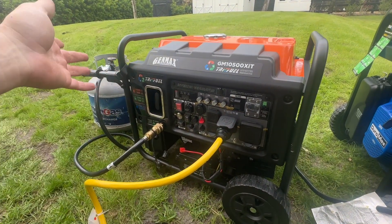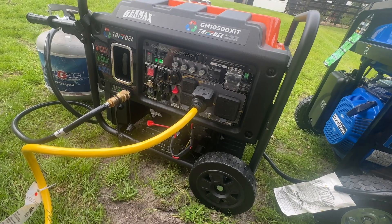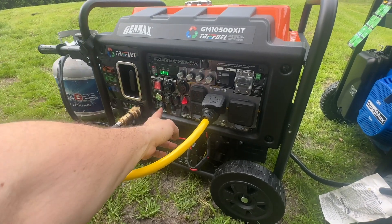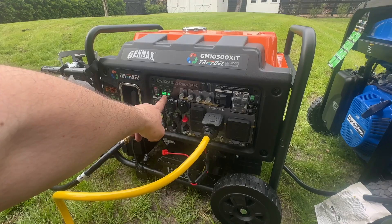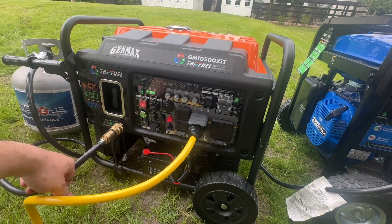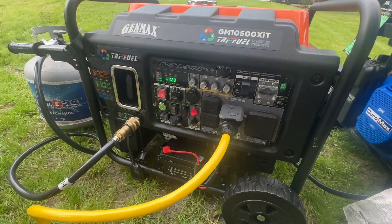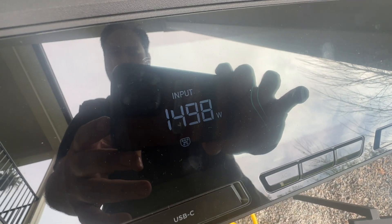These are the videos nobody makes on YouTube — non-sponsored. This is a cold engine so you'll see how it starts. The GenMax 10,500 sings like a banshee; it's not as quiet as the Duromax, but it's half the price of their boxed inverter generator. Voltage is at 240, breakers off, main switch on — let's give it a spin. Low idle is off. Look at those hertz — the nice thing about the inverter is it doesn't bounce the frequency up and down. I've got it set to 1,800 watts right now; let's give the EcoFlow a charge.